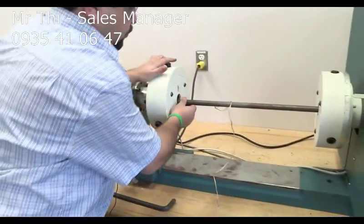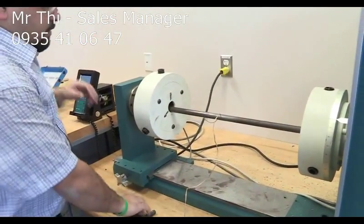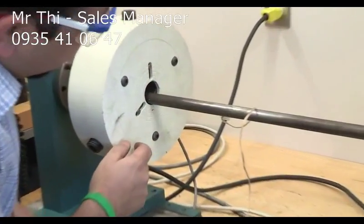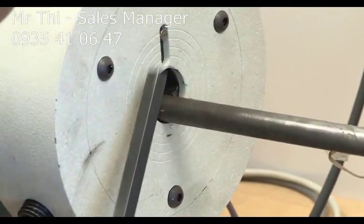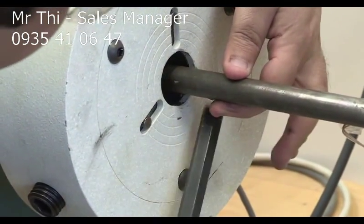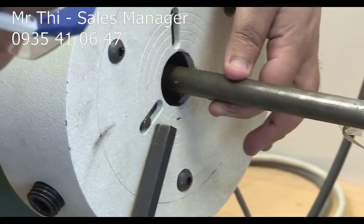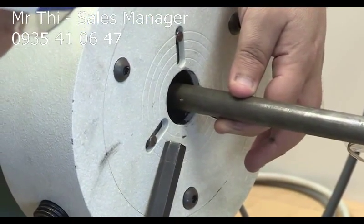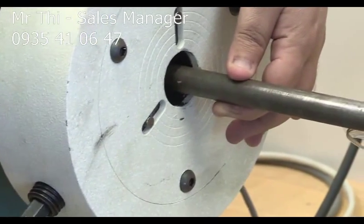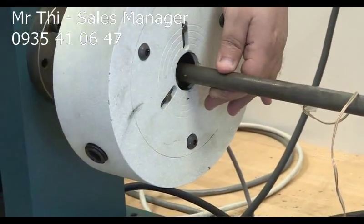And then we want to tie the specimen, and we want to center it right in the middle. And you see those circles? If you see these circles, so very much you want to center that. This should be your guide to center the specimen. So those screws here, very much they have to align at the same circle. And normally they end up at the second circle, so which means that you need to move this a little bit inside. So you tie this guy, and then tie this a little bit more.